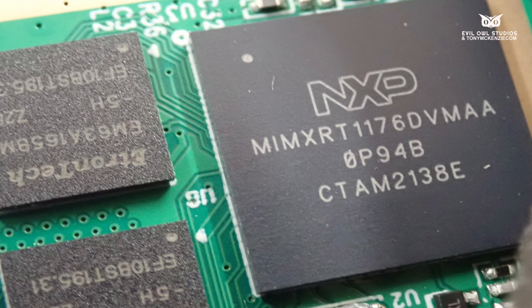It's got a low dynamic power consumption with integrated DC-DC converter inside. I've probably showed it you in passing, but don't worry too much about that. And it's got this low power run mode at 24 megahertz, which also helps, really. It's highly integrated, and it uses advanced multimedia for GUI and enhanced HMI. It's got multiple display and CMOS sensor interfaces, and a thing called OpenVG Graphics Accelerator running up to 500 meg.